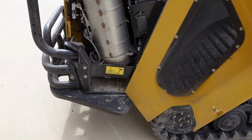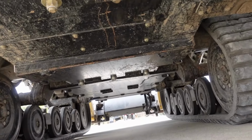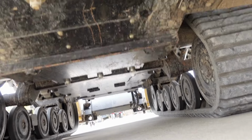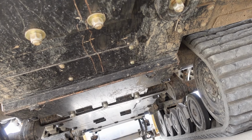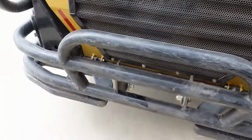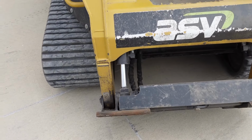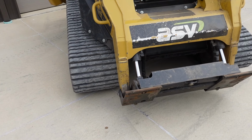You always want to blow it out and then wash it. Now the belly pans are not too bad to use. You take like a 9/16 wrench and go under there with your impact and zip them out. What the problem is, they have several doors, and the front one opens towards the front, where all the rest open towards the back. So I can crawl under the back and get to all of them except for the front. The front, I have to basically have 2 people, because I have to have the loader raised, or the bucket raised, so I can crawl under there.